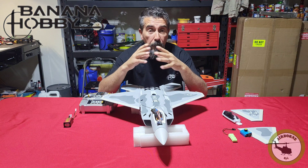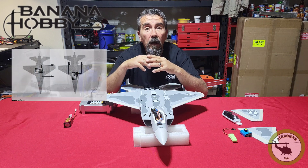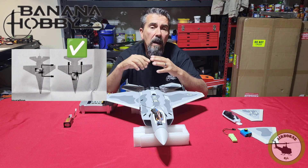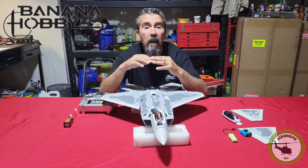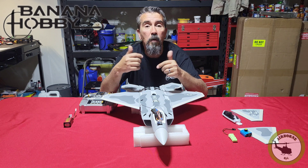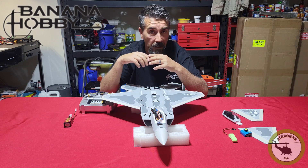Now that you're familiar with the gyro layout, here are some additional hints. You'll notice it wants the gyro with the pots face up, laying it long ways like this. That's what switch one — simple airplane mode — is about. We'll just keep it in airplane mode, no mixing; we'll let the board do the mixing for us. If you ever use this in another plane and want delta wing mixing, you'd have to turn it 90 degrees — but we're not doing that in this model because we just don't have the room.